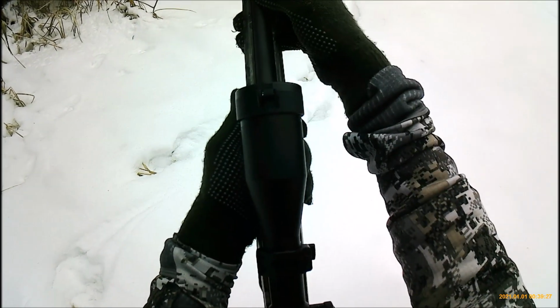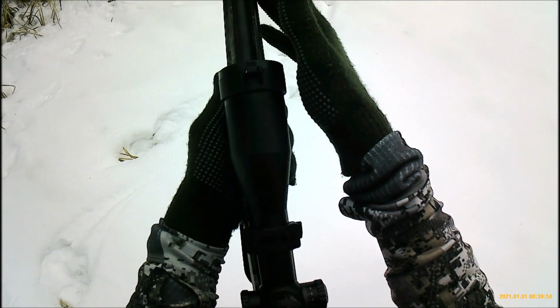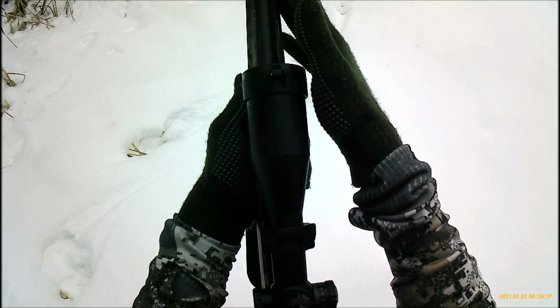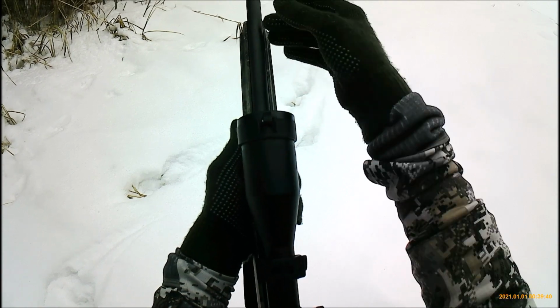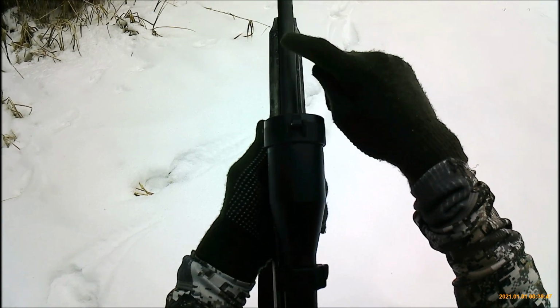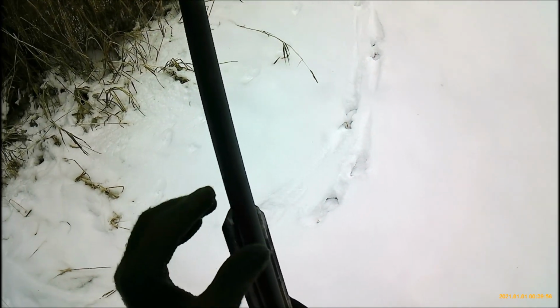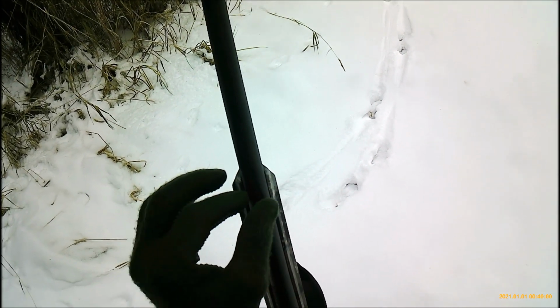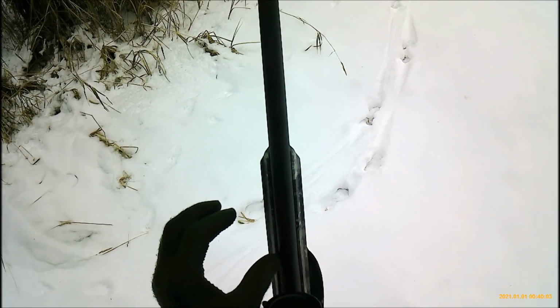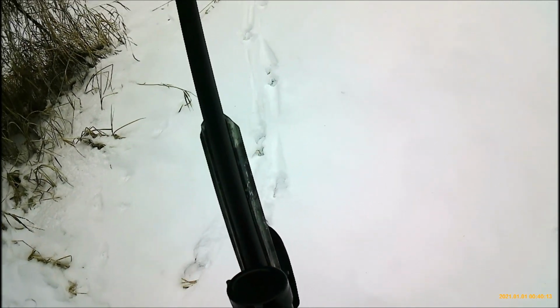And if that still doesn't fix it, on my 223 rifle that shoots 0.4 of an inch at 100 yards right now, that accurate, what I did there is grab a socket, wrapped around with sandpaper, make sure the socket is the correct size to fit into the channel of this stock, and then slightly sand it down. You might have to have a little bit bigger socket or a little bit smaller one, depending where the material is that you want to remove. Just make sure to go easy with a finer sandpaper and check your fit at all times until it fits the way it's supposed to.